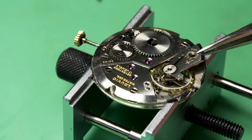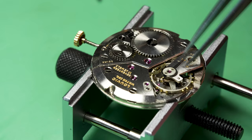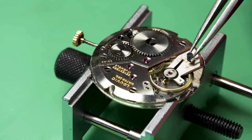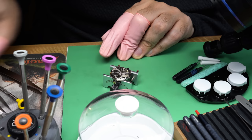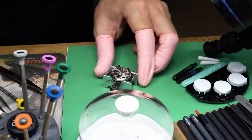I'm going to take it off and put it back on, making sure it's 100% flush and seated flat, then try this again. Being up just a little bit can just lightly rub on the balance wheel, and it doesn't take much to stop the balance wheel — really, it doesn't take much at all. After reseating the pallet fork bridge, now it's running how it should. No hesitation, no stopping, no rubbing — it's just cranking right along. That is exactly what we were hoping to see after having completed this reassembly.